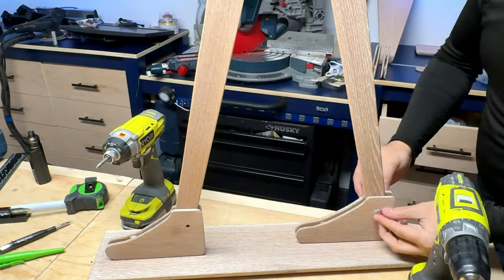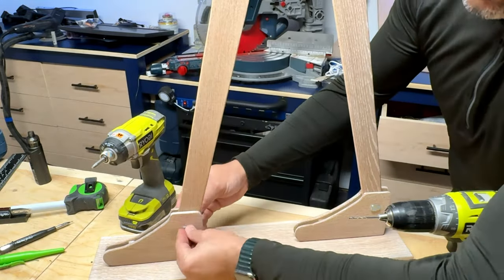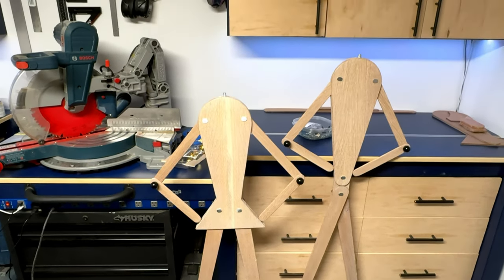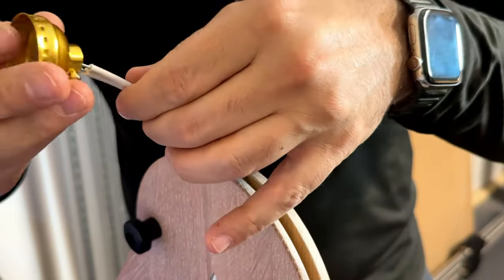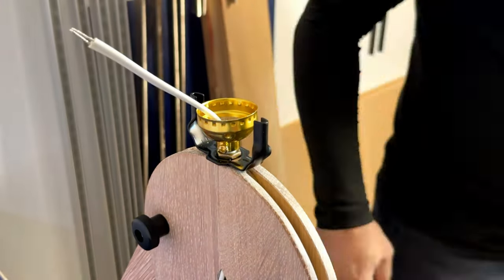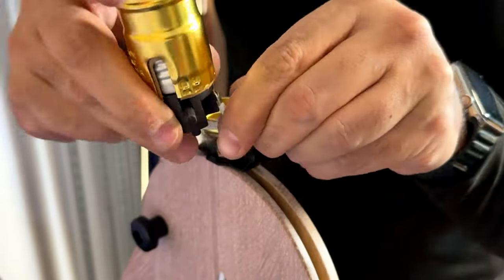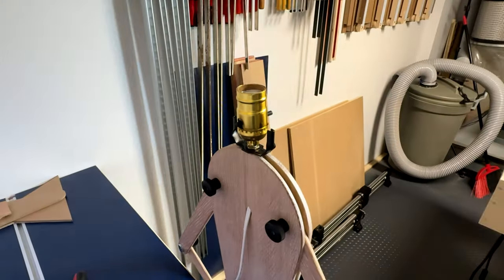Initially the goal was to have the knob showing in the front, but Mrs. RV Woodworks had other thoughts — she thought the T-bolt would look better on the outside. Now, I'm no electrician, but the wiring for a lamp isn't very difficult. There's no positive or negative — either wire can go on either side. One suggestion: when hooking the wire around the screw, make sure the hook turns in the direction you're going to turn the screw. This ensures that as you tighten the screw, the hook goes inward instead of turning the opposite direction and coming out again.